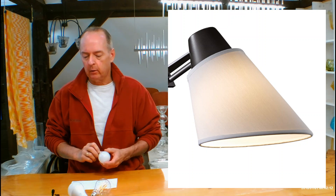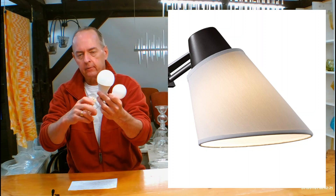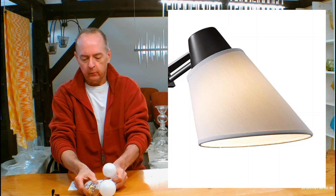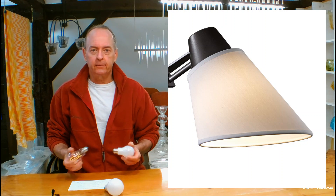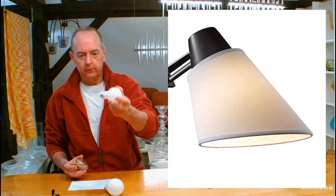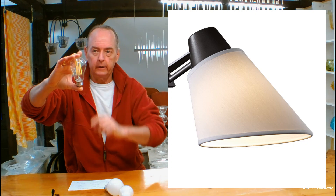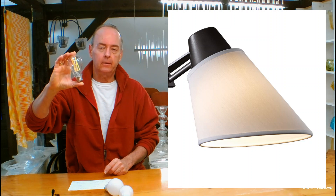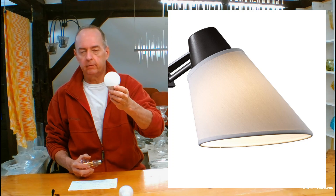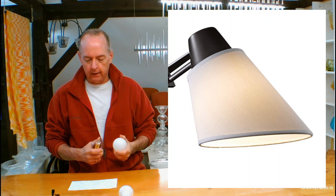You can still use an incandescent bulb, but I'd probably just go for LEDs because they're so good now. This is a regular standard LED — the old-school type. This bigger one is the new phosphorus type with those cool orange things inside. With LEDs, the rule of thumb is use whatever can physically fit in the lamp. They don't generate much heat, they generate light, and use very little electricity. This is a GE LED, maybe a 60-watt equivalent — that's an A19. This one is an A20, which can go up to 100-watt equivalent easily. I've found them up to 150-watt equivalent. And then this big one is an A21, just a little bigger — I've found those up to 150 to 200-watt equivalent, so you can get a lot of light out of this if you need to.